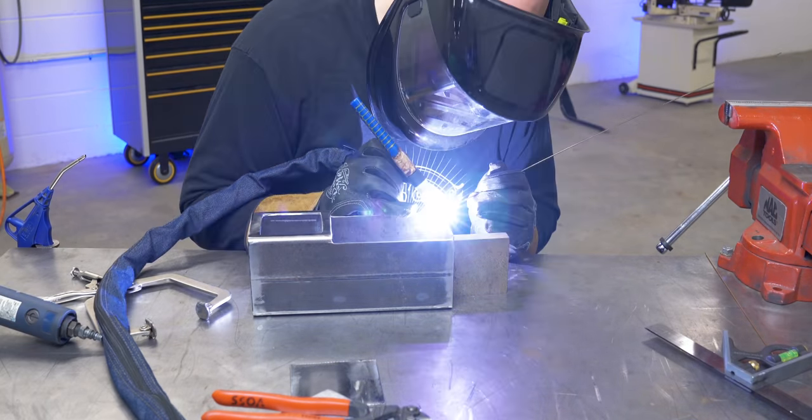Okay, so I misspoke earlier when I said this was 1/4 inch thick. It's actually 3/8 inch thick. So it's a little over 9 millimeters. So if you were following along exactly and you've already ordered your material, I'm sorry, my bad. I could not find anything around the shop 1/2 inch thick, but since these are 3/8 and this is 1/8, I can lay this on top of here and use this as a spacer to get this positioned in there. So this combined is 1/2 inch thick, which is 12.7 millimeters. That's how high we're gonna be holding it up off the floor.